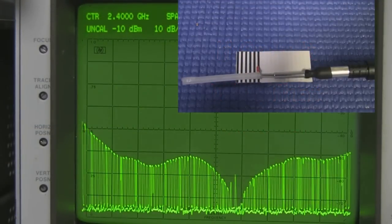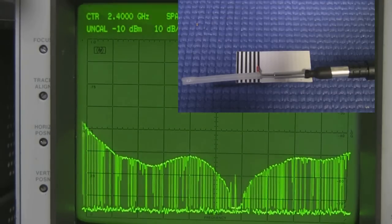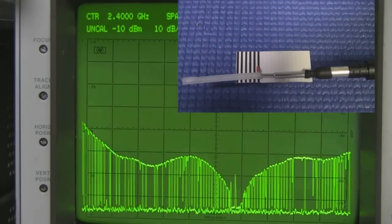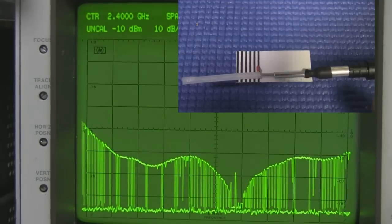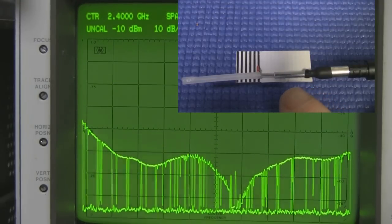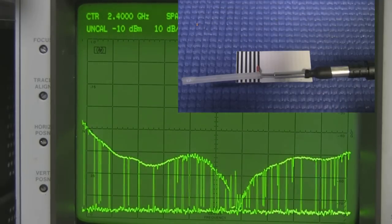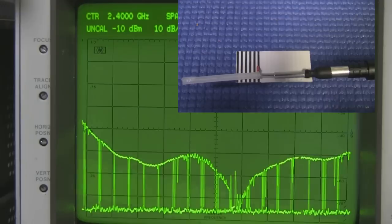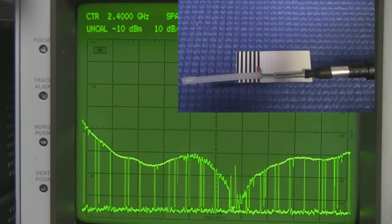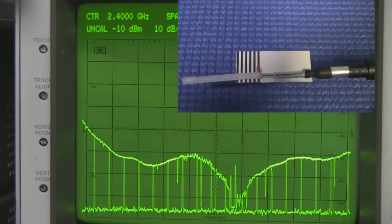I've got a couple of experiments to show you that I've been doing as part of two videos releasing over the next couple of weeks. The first one is to do with a short dipole antenna — these are really common. I've got a commercial version purchased off eBay for about 50 pence, and I've modified the driven element so I can extend it out to 31 millimeters and bring it back down to 25 millimeters to show the difference, because I get a lot of comments saying 25 millimeters is not the correct wavelength for 2.4 GHz. This particular antenna design makes it a little bit shorter.